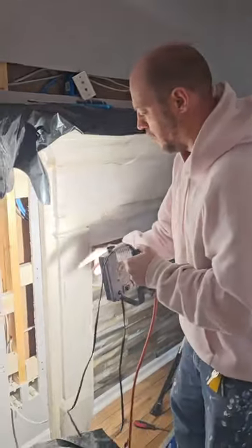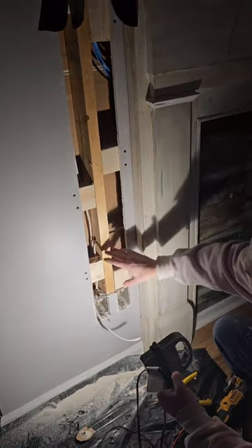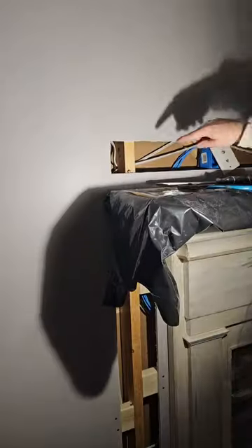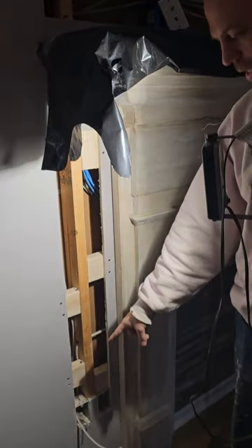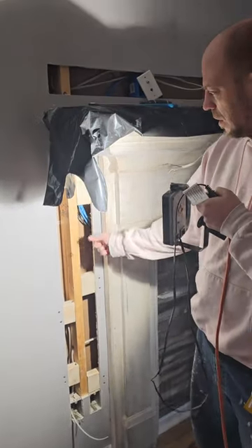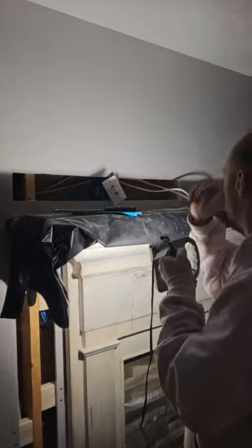Our initial deal here is we took these plates off — we didn't even cut this. I measured over from the corner of the wall for these two right up here, so that's where I knew to cut. We opened it right up, we saw these and we saw our wire, we knew we were in line. The problem was with them being stapled going down the stud. That's what made us have to cut this out so we could get these backed out and actually get slack on all these wires and pull them up and feed them to the new spot.